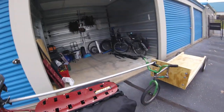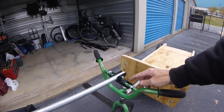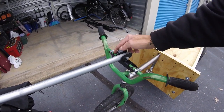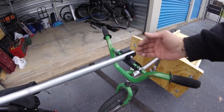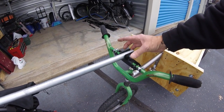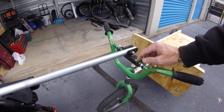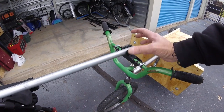Back here, this is the weak point in the design right now because this bracket holds the tube. But I just zip-tied it there, and then I put this little bracket on each side to keep it from sliding back and forth. There's one single bolt that holds it on, but that's pretty strong. I'm going to have to figure out a way to attach this bracket better to this tube, but it has to have the ability to also pivot.